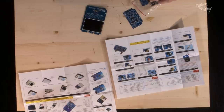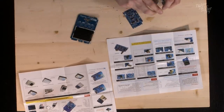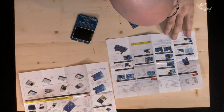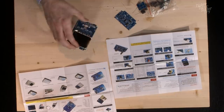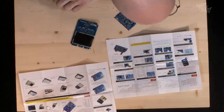That's the SMD parts list. We don't need those because the SMDs have already been assembled. We need to check the parts on the back here. So check the main board. Before mounting any parts to the main board, connect 9-volt power supply, center positive to J7 on your board, and check the display. Well, we don't have a 9-volt power supply, so we'll just jump ahead. You see your scope boots up to a screen similar to the photo below.